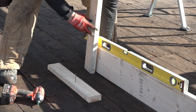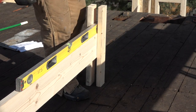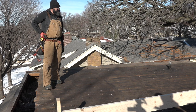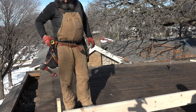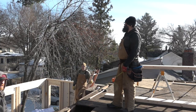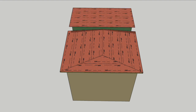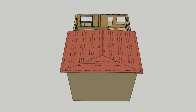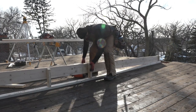Step one of framing the roof is setting the ridge beam. Steve levels the ridge beam across, temporarily tacking it in place so that he can test drive various rafter scenarios. Inevitably that includes sentences that trail off and a carpenter muttering numbers. What he is nervous about is that the addition also has a flat roof and this little ridge should not extend above the addition's roof. The reason Steve was scratching his head was because the trusses for that roof hadn't arrived yet. With a rough idea of what's about to unfold and trust in the blueprints, he frames the ridge and braces it level.